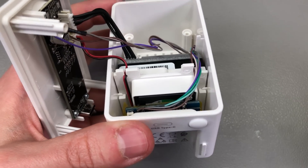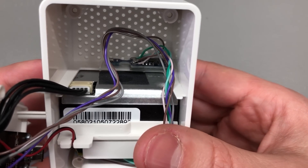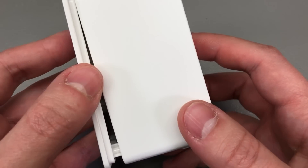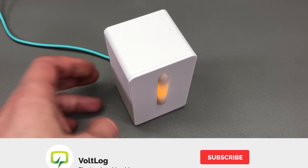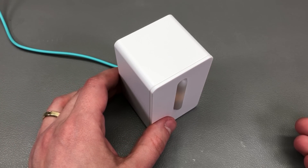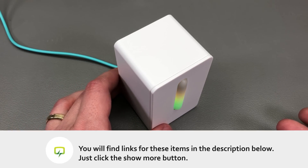Here's a view of the final build. I also had to cut a channel to pass the wiring on this side of the plastic. Here is the BME680 sensor attached with a small piece of double-sided tape, and now I can screw down the enclosure. Do you plan to get one of these sensors and hack it yourself? This could be a fun weekend project — there's such a wide variety of things you could do inside this enclosure. You can even mess around with the fan speed control using a transistor driven from a pin on the ESP8266.